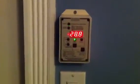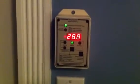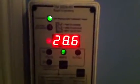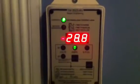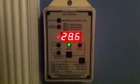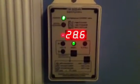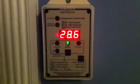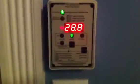I'm now looking at the Ames inverter and this is the watts being drawn off it, which I'm not too excited about. My trimetric here is telling me I'm pulling 28 watts. I can take five off because I know the charge controller uses about five. So this Ames 2000 watt pure sine is drawing 23 watts. That's a lot — I'm not too happy about that. I know it's a much better inverter than a modified, but it's something to consider. That's a big draw.